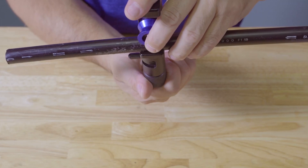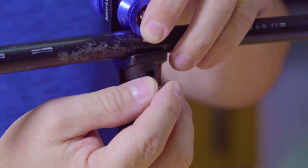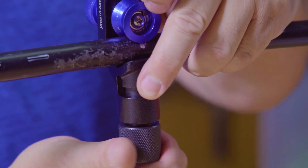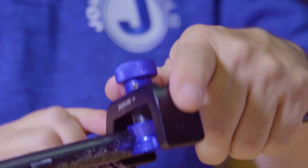To perform a ring or radial cut, retract the blade by loosening the black knurled knob. Move the lever so that the blade is now perpendicular to the B groove in the tool. Tighten the black knurled knob and rotate the tool around the cable. Remove the tool from the cable.